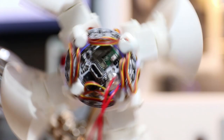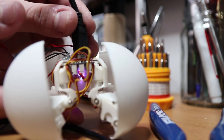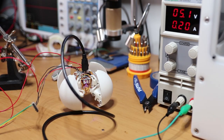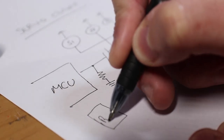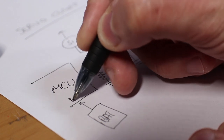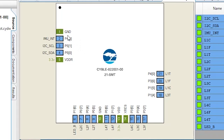The next issue is the servo powering circuit. As you saw in the build video, I don't have a main cutoff for the servos, which makes the onboard battery charging circuit useless. My main concern is that the module and controller have a limited number of pins — I'm using 12 pins to control the servo motors and other pins for sensors. Ideally I'd have two more pins: one to monitor battery voltage and one to detect USB, but the module is running out of pins, so we either need to free some up or use a slave microcontroller.